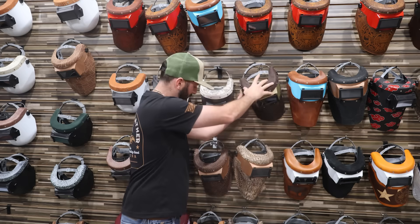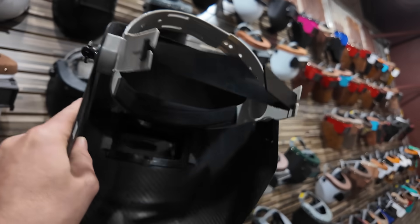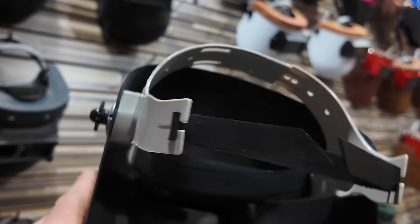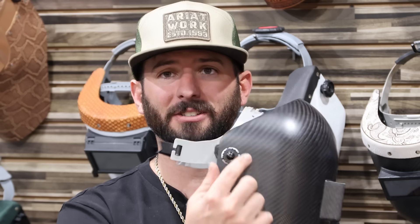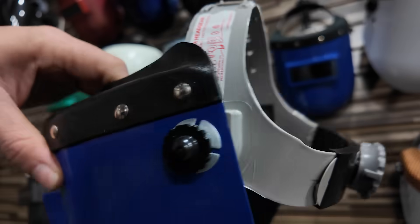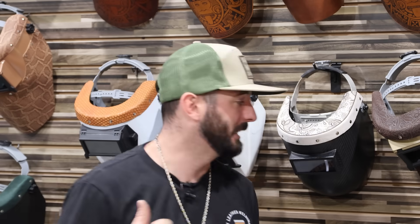If it's something like this headgear with elastic, that's the absolute worst. I've seen people use it but I just don't think they use their hood all that often. Not to mention the plastic hood nuts on the side — they come pretty much standard with any one of these pipeliners and they strip really easily, so it's only a matter of time before they're just not going to get tight anymore.